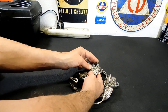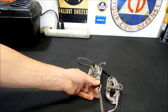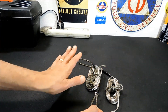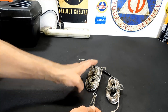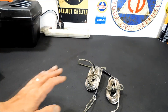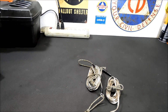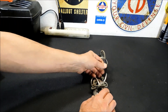On the ends of the antenna I have two little electrical connectors. You're going to need two of those. I have the antenna hung up through them so I can hang this anywhere — like on a fence — without closing an electrical circuit that would make the whole fence an antenna. I want to isolate it so I can hang this on metal, wood, a tree, whatever, without detuning the antenna. You'll also need electrical tape to keep things neat.